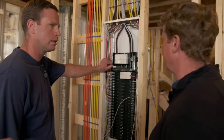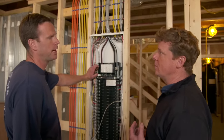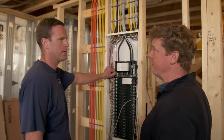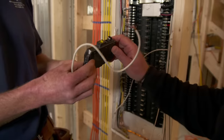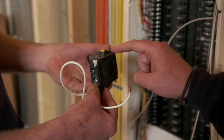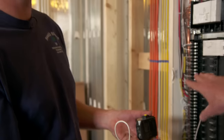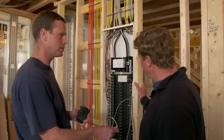Hang on — pigtails, let's break that down. Arc fault is something we basically need now in every new house, right? Right, that's what's going to protect us against fires, flash faults, things like that. Wire gets damaged, you get a little electrical jump between the two and boom, you've got a fire. So what's the pigtail part? The pigtails on a traditional panel would be a little extra wire that you actually have to physically put in the panel, hook into your neutral bus, and that would feed the neutral so you could hook up the circuit to the arc fault breaker. So every one of these that's arc fault — does this hold for GFCI as well? Yes. The ground fault stops us from getting shocked if we've got a wet hand. Every one of those two breakers has got this pigtail, which means nowadays this panel is going to be filled with these. And it gets really tough to do a neat job with it too, so it's kind of a pain.